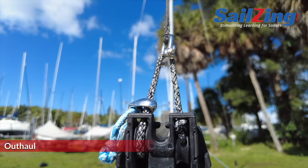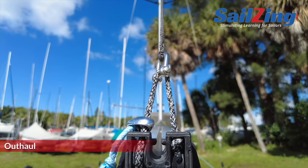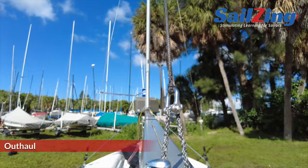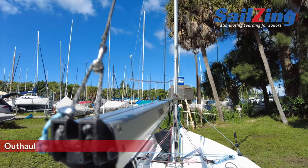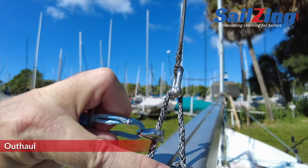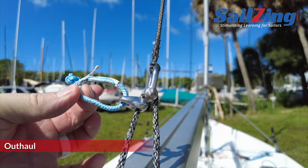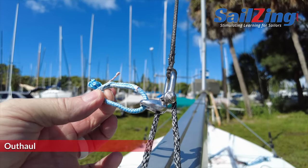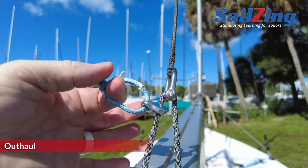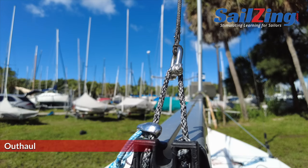The right side of that will be basically tied in there. There are a couple ways of handling this with the outhaul grommet. You can either just tie it off straight to the grommet, or what I did is I have this little guy that I leave attached. I have this tied here, I have this attached, and then I put a soft shackle on it so I can put the soft shackle through the sail grommet. And I like this methodology because I think it reduces friction here, and this makes it easy to attach to the sail. So, you know, there are various ways of approaching this, but that's the way I've done it.